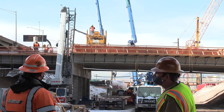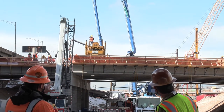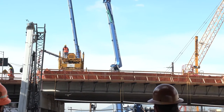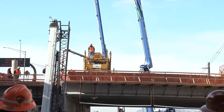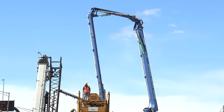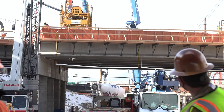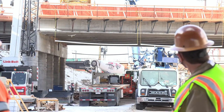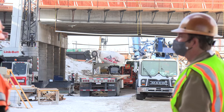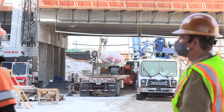What's happening today right now — you can see the concrete girders. Those go on top of the abutment and the piers, so we have our columns and the pier. Basically, we are building the bridge that goes over I-70. The blue arm that sticks up is the concrete pump truck. That is taking concrete from below grade and pumping it up to the bridge deck. Instead of hand-placing it, you place it with the pump truck. We actually have two concrete pump trucks — one is a backup in case the other one goes out, so we have a concrete truck on site that doesn't slow down and we continue to pump the concrete into place.